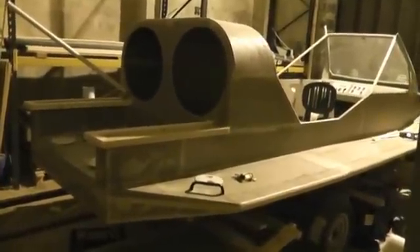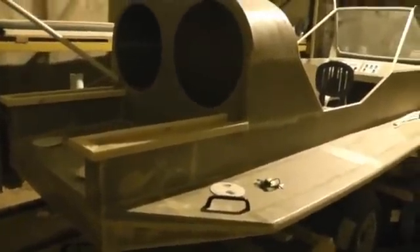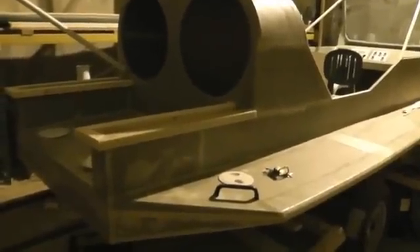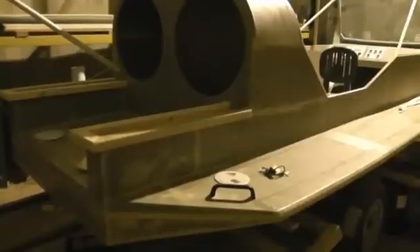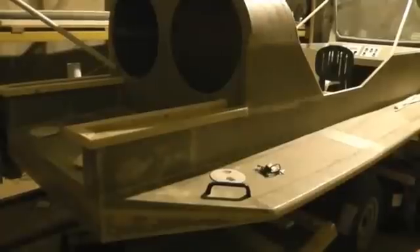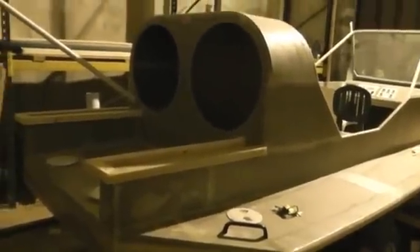Anyway, let's go for a guided tour of the hovercraft so far. The hull's about three quarters of the way complete now. It's an 18-foot hovercraft made out of foam composite — layers of foam which is Tri-Cast 4 and 5 — and they've been wrapped in fiberglass which makes them incredibly strong yet light and very buoyant, which is an ideal material for a hovercraft to be built on.